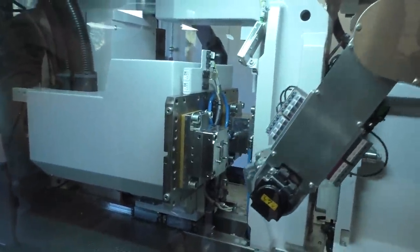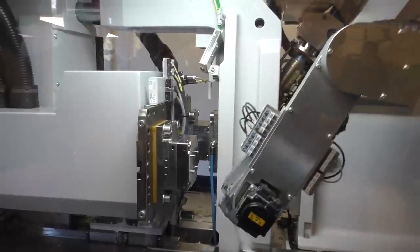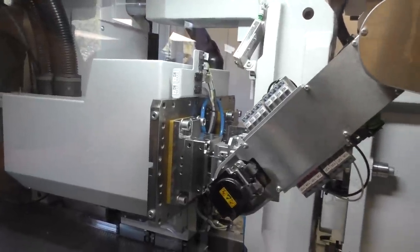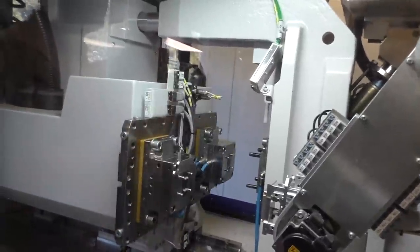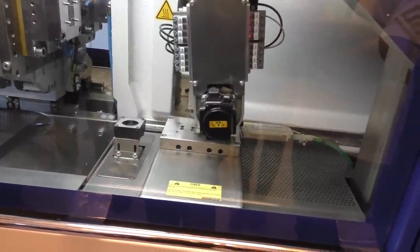Probably you know the plasticizing unit on this machine is pretty small. It is just 12 cubic centimeters, which means that we supply cavities with fresh material all the time. This machine would be very good for the production of components which must resist UV light, sunlight, or flammability. Usually those materials need to be stored in heat in the barrels for less than 10 minutes. In this case, we keep them only 2 or 3 minutes, so it is pretty fast production and very safe.